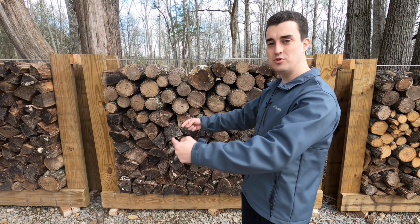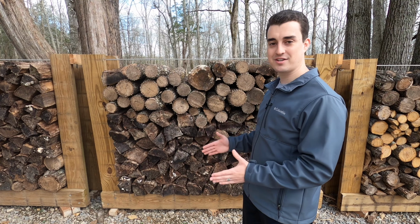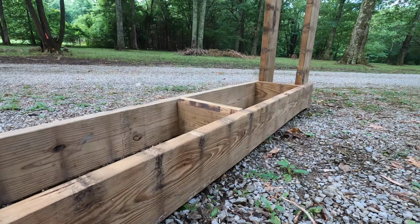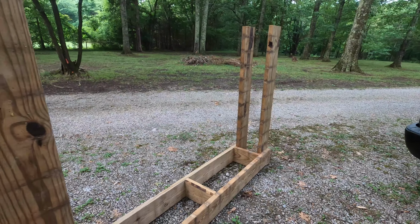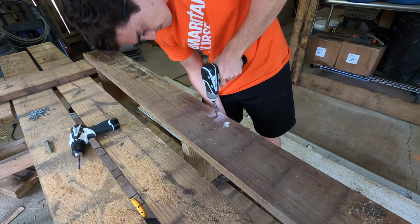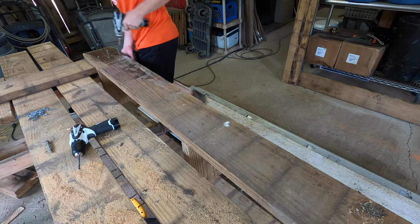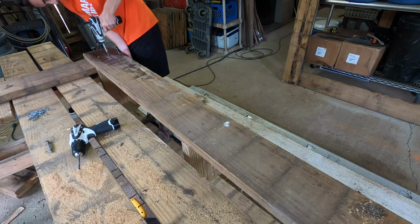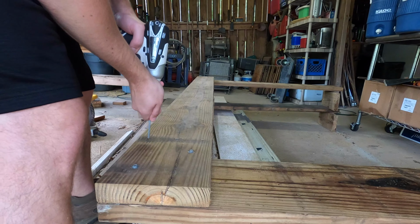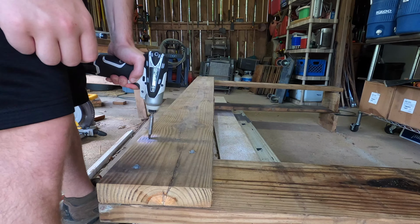So you've got 2 U-shapes. Now you need to connect them. So those 10-inch pieces, put one on each side flushed up on the inside of the 2 5-foot vertical pieces, and then one in the middle. So 3 4-inch wood screws on each side. So you've got 18 4-inch wood screws, and then 8 3/8-inch lag bolts.